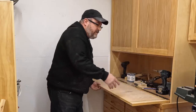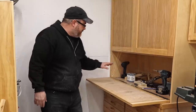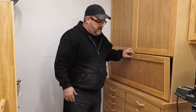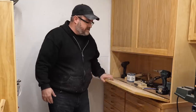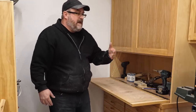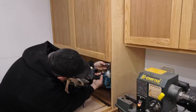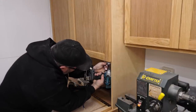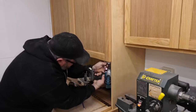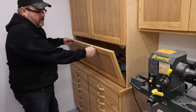So there are a couple of different ways I can deal with that. One is that I can move the hinge out a bit further on this side and move it further in on the other, because I actually have it spaced a little bit right to try to give it some clearance. So move it in on this side, pull it out on that side. That will correct some of it. And then I think I have a pair of magnets that I can use to hold the door closed. And being held in like that over time should remove some of the twist as well.